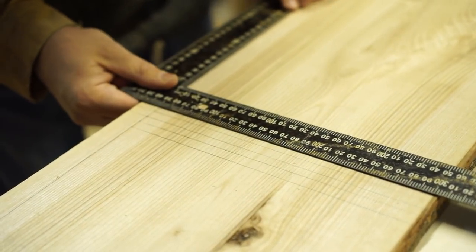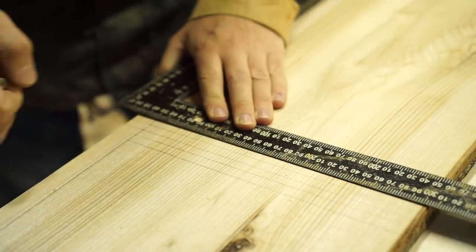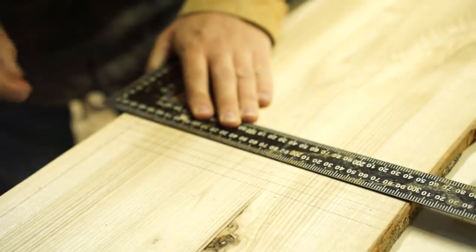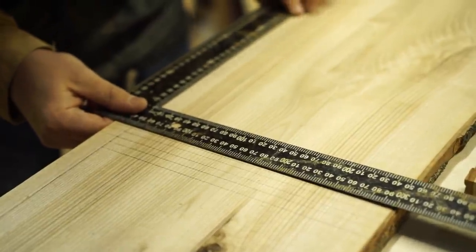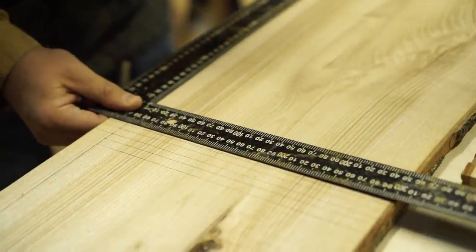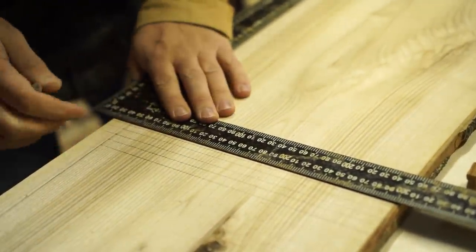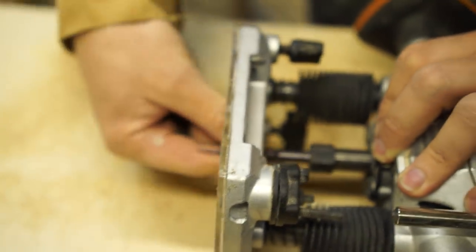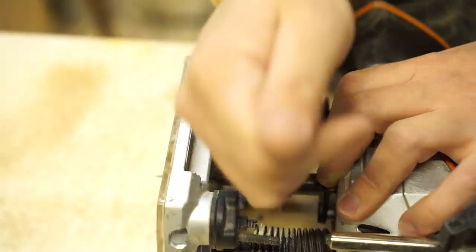I've got an upcoming project that needs some kerf bending, but I've never done any, so I wanted to exercise on something smaller. The gaps you get when doing the kerfs are a big no-no for me. I don't want to do any lamination, and the strength is also a concern. So I came up with a pretty simple solution to that. Just use a router instead of your circular saw.